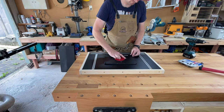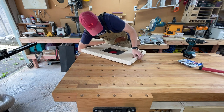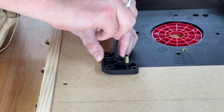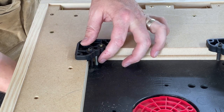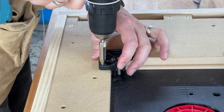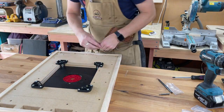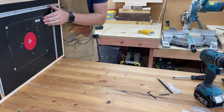With the table done we can start to attach the insert plate. I started by laying out all the levellers and roughly inserting the levelling grub screws, then I add the top screws without tightening them. This is to ensure that the levellers are in the right place before screwing them into the table. Once I'm happy with their position I use a self-centering drill bit to pre-drill the holes and attach the levellers to the table. When they're all attached and you're ready to fine-tune the level, take note that the grub screws are there to do the levelling — the silver screws are simply there to hold the plate down. So make sure you get it all level before tightening the silver screws.